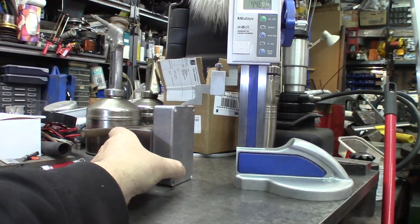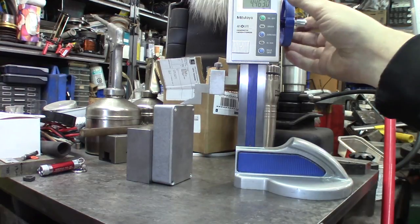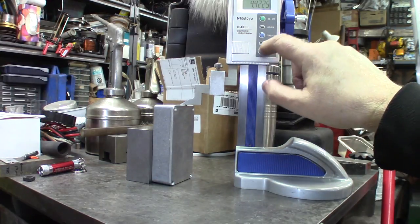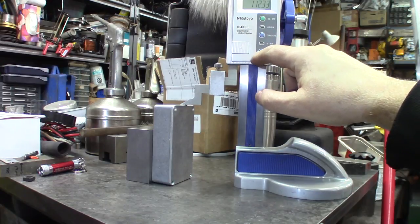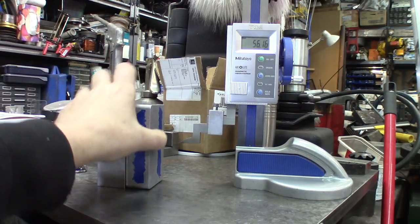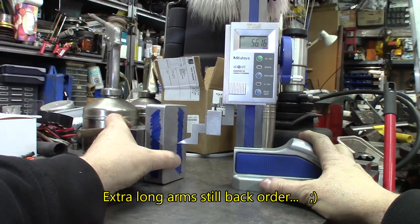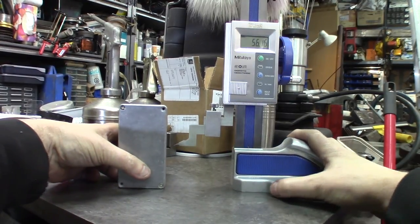Let's see what we're reading there. Four inches, 422 — I get metric: 112.33 millimeters. We'll divide that in half and we'll make a center line. We'll get the same principle on the other side, making a half mark there too, just to kind of double check and get in the middle. We want this box to be centered, so we'll start making the measurements from the center.